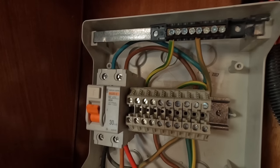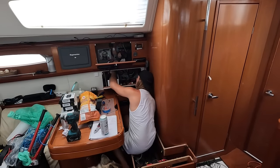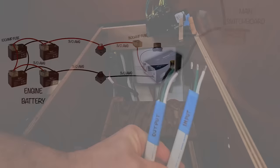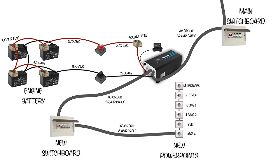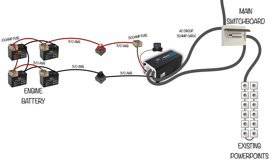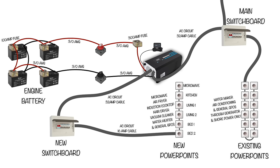Now that we've got the batteries, solar panels, and DC-to-DC charger sorted, let's go back to the 3000 watt inverter charger and talk about the AC side. We have 220 volt AC circuits on our boat already set up with shore power and our 5.5 kilowatt generator. We ran the 220 volt circuit down from our switchboard to the input of the inverter charger. For the outputs, I ran a whole new circuit through a different switchboard connected to isolated power points throughout the boat. I kept the boat circuit completely isolated and separate so I have the option to keep the inverter charger off while running the generator or connecting to shore power, allowing full power use through the whole boat rather than being limited to 3000 watts.